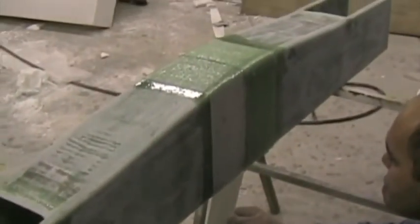And here we're busy with the next lot, and pulling it as tight as you can, and then wetting it out, and keep rotating the carry through spar on the trestles. Keep one person keeping it tight and then the other person wetting it out. There, we've finished wrapping the center of the carry through spar, and we've put peel ply on as well.